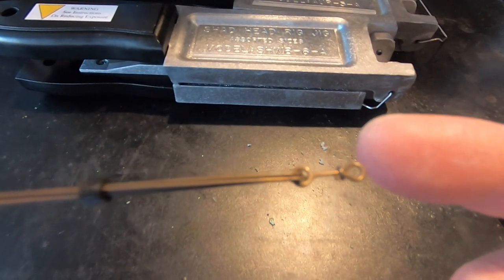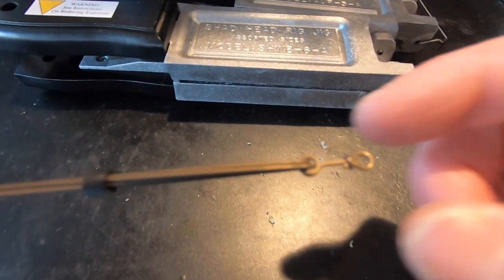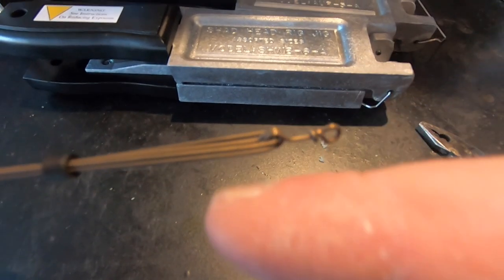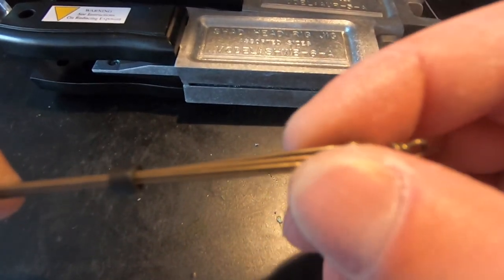This is actually the second time I've ever made an umbrella rig. After my trial run I realized you need to make sure the top part of your umbrella rig - the part that goes in the mold - needs to be hot. You need your mold to be hot and your wire form to be hot, because there's a lot of metal getting in the way of that lead as it goes into the mold from the sprue. If it's not hot enough, the lead will cool and harden before filling the mold completely.